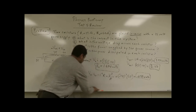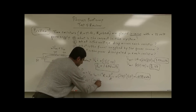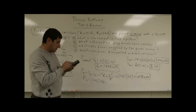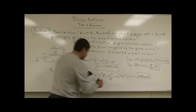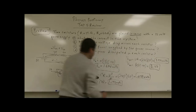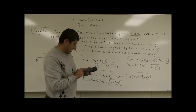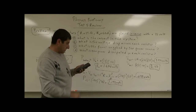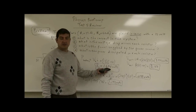The power dissipated in the 60 ohm resistor is 0.141 squared times 60, which gives 1.196 watts. If I add the two: 1.196 plus 0.498 equals 1.694 watts. So the sum of the power dissipated in each resistor equals the power delivered by the battery.